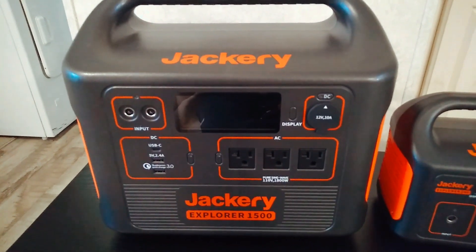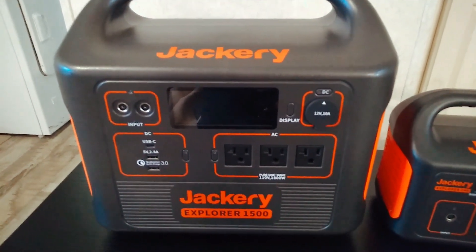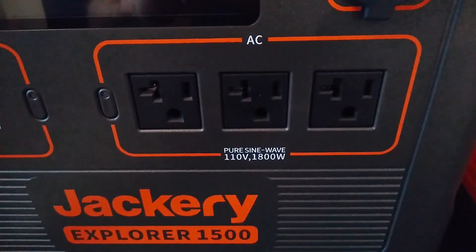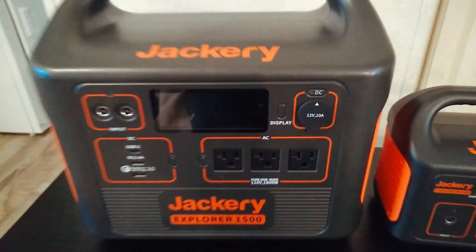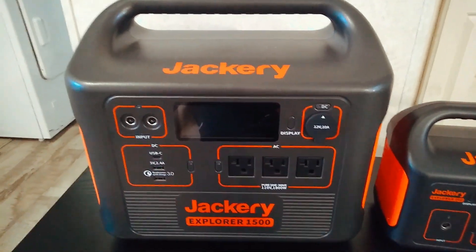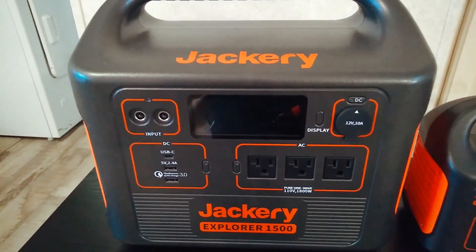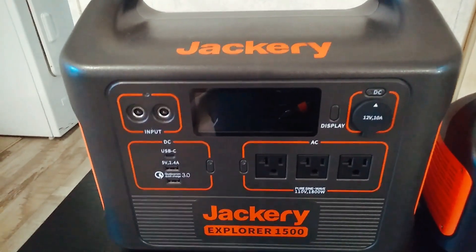But if you're just doing a small load — like one thing I like to power is a TV — so like a 50-watt TV, if you had just a small load like that running off this big inverter, you're just going to be wasting a ton of power. An inverter of this size actually uses about 15 watts or so just being on.